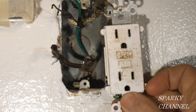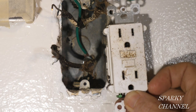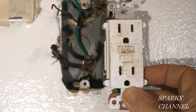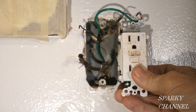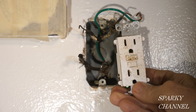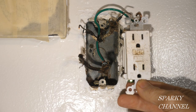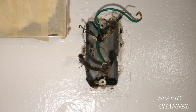The problem with this old GFCI receptacle is it's old, it's got paint all over it, and it's got cockroach poop on it — and it did not work. When I pressed test it wouldn't test, and when I pressed reset that wouldn't help either. It was working as a receptacle but it wasn't protecting anything downstream. Since this GFCI was not working properly, I'm not going to trust that the wiring was correct — I'm going to test it out for myself.